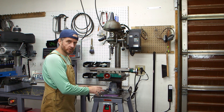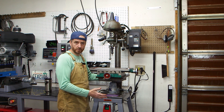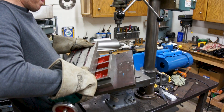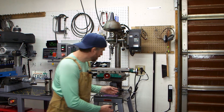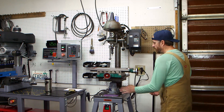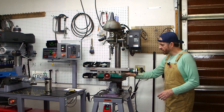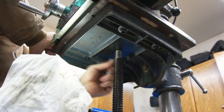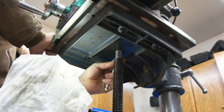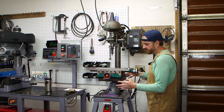The first thing I want to upgrade on the drill press mill is the way the table is mounted to the press itself. Currently it's supported on the drill press's original table, which is held to the column. As I move the linear screw up and down, the table rides on the column and that's what holds it. It's locked in place with a clamp on the column. Because I opted not to bolt it to the lead screw, and because there's nothing to hold alignment, you get a lot of movement. That's not ideal.